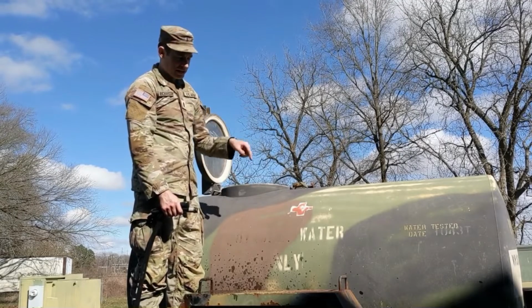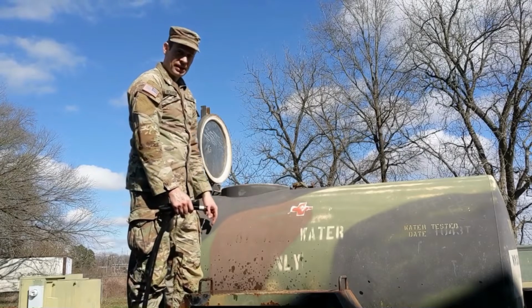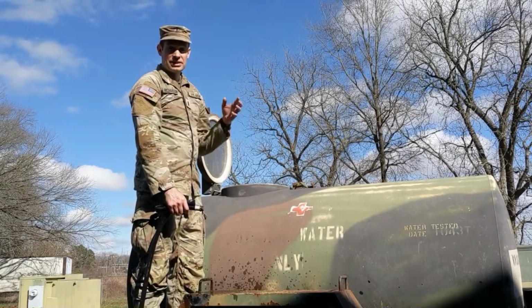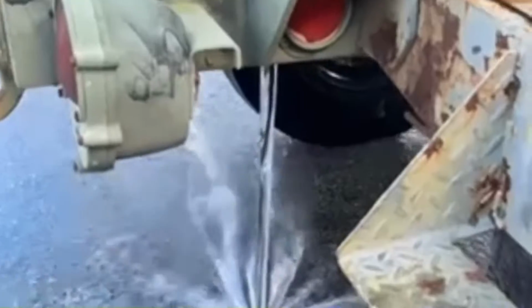So after it's sat for about 30 minutes with the bleach solution inside, you can drain it out. I had to turn this around actually so that I could fully drain the water inside from the plug underneath. And then it's important to actually rinse out that high bleach solution with some more spraying.